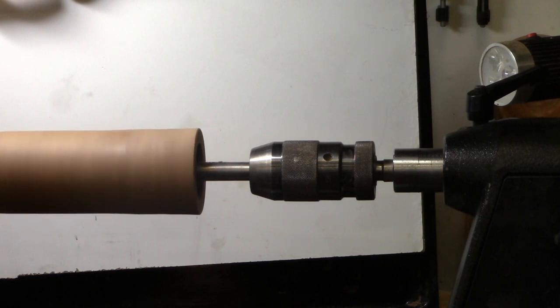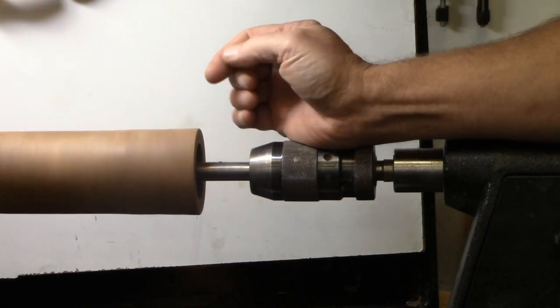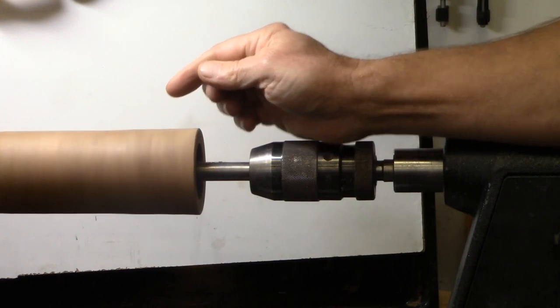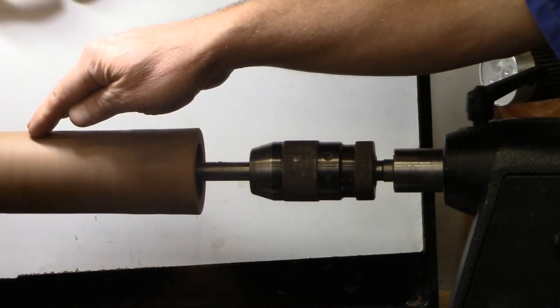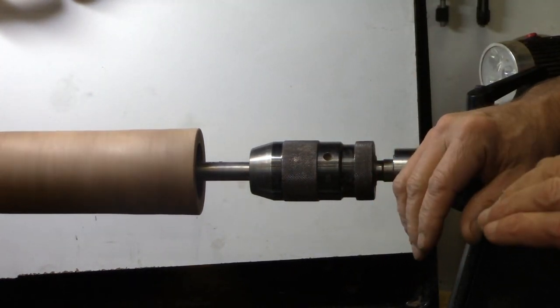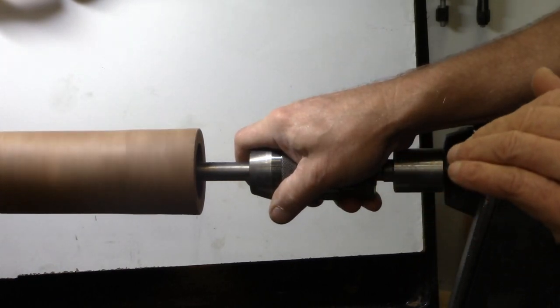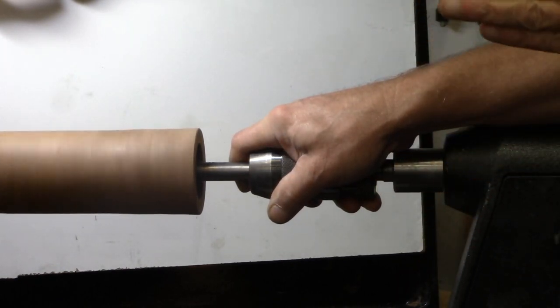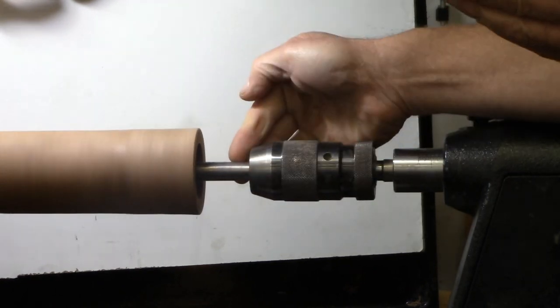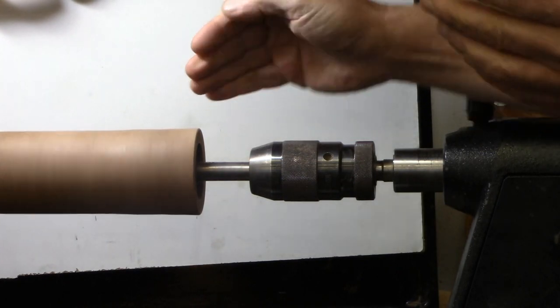Because if you noticed, when I first started cutting, I was getting a little bit of chattering, but I want this one to be dead center. If the cylinder fits in there dead center, my alignment to the top comes out right. So by speeding it up to about 1,000-1,200 RPMs and holding on to my chuck, it makes that center true itself up. And you can see now I get no jump out of my bit. It's just dead.